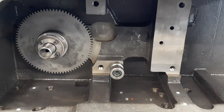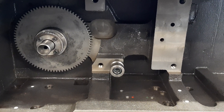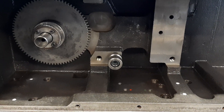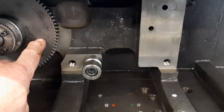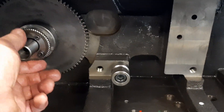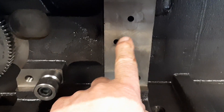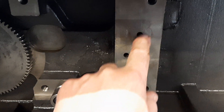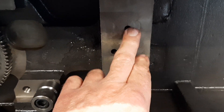We seem to have enough light in here so you guys can see what's going on inside. As you might have seen in that previous video, you had this gear sitting on the end of the shaft there, and on the other side was that hydraulic cylinder which actually drives the turret out - that's already bolted on there now. There's another gear there for a sensor for the CNC controller, so it knows which tool position it's in. You can also see a couple of holes that have ported through here - these actually bore in and port across to that hydraulic cylinder. That's the unit that pressurizes first before the actual unit can drive in a rotational position.